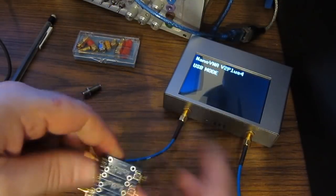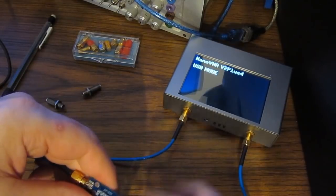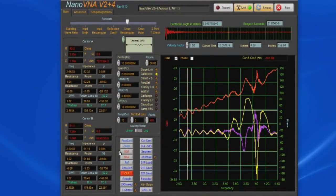And now let's reinstall our low-cost 30 dB attenuator. And you can see it's a little better, but it's not near as good as our Midwest microwave part. You can see up at about 4.4 gigahertz, it's reading about 24 dB. Now again, as we start working below 3 gigahertz, I haven't found a need for that leakage term coefficient, so that's something you just want to keep in mind.